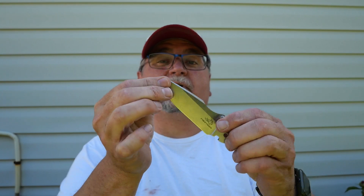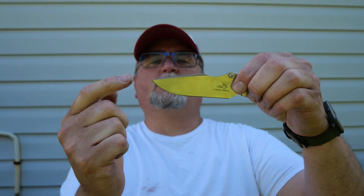This blade is the FreeTiger FT21 that I broke the tip off of. I've already done the video on how I repaired the tip, so it's got a reasonable tip right now, and since it's a repair anyways I'm going to try stonewashing it. I've got to take the thumb studs off first. And then I've got this knife — one of my early knives. I've got two Enlan EL01 knives, and since I thought I'm going to do one, might as well do two and give it a try. This is D2 apparently and this is 8Cr13MoV, so I just want to see how they do.